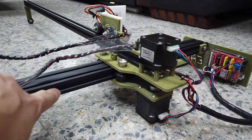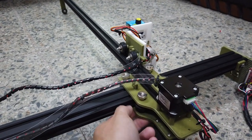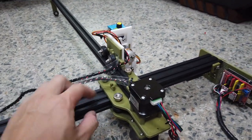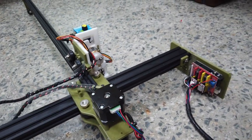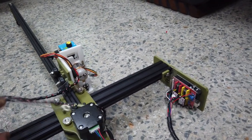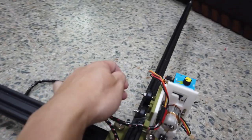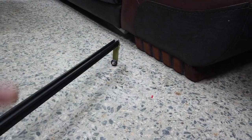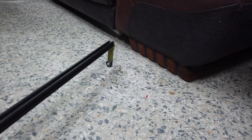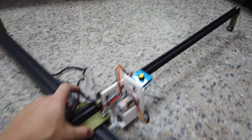In terms of the tolerance between the roller and the aluminum extrusion, it's really well calibrated. Some of the beta testers also tested it and it works well and smooth. There are 4 rollers on the Y side, 3 on the X plate, as well as one as a support for the X axis. In terms of flex, it's tight enough — good enough for foam board cutting.